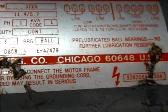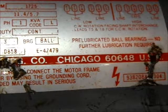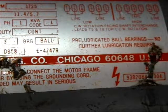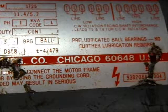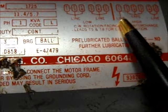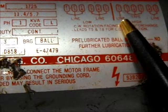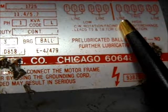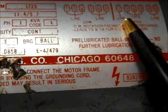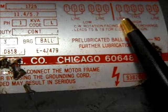Now, the way you would run 220 volts on this motor would be like a 115 volt setup, except you won't be using the white wire as your neutral wire — the white wire will become a hot. So for example, I'm going to take wire T1 and hook that up to the white wire, which would normally be a neutral for a 120 volt setup, but for the 220 volt, you're going to use that as a power wire, a hot wire.